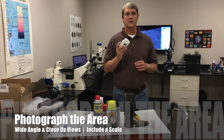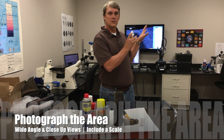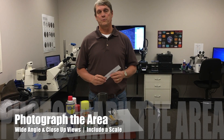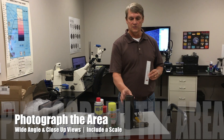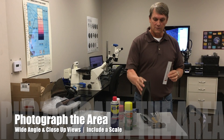If something fails, the first thing to do is to take photographs of the failure location of the entire area. Take some photos from a little bit of a distance away from different angles, and also take pictures close up. That gives different perspectives on what you're dealing with in terms of how big the failure is. You could also use a scale if you're taking close pictures of the failure location to give an idea of the size.